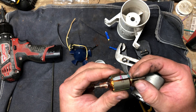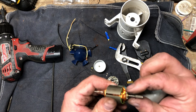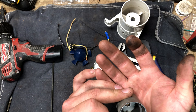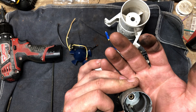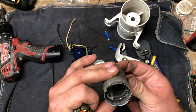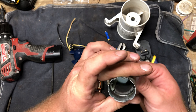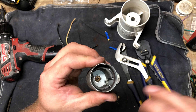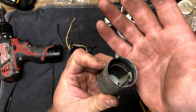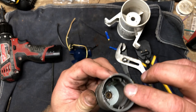Here's the actual commutator. We've got some more of those shims. Looks like they used one of those bronze bushings as a spacer. Up front we've got another bronze bushing with what looks like a knurled tooth pattern, pressed into the metal body at the front — which is of course where most of the axial forces are going to be. The laminations are actually epoxied in there quite nicely, with a nice even bead of epoxy holding them in place.